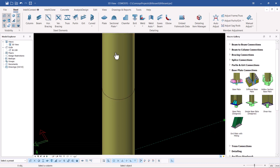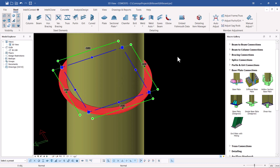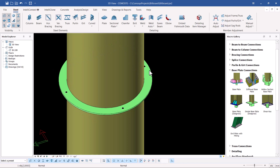I'll come to base plate, and then to hollow section base plate. I'll select that so I can see the base plate in place. I'll double-click on it to get the editing dialog box. I've double-clicked, but the editing dialog box I got is just for the plate at the bottom end. With it still selected, I'll press M then N on the keyboard to bring up the property dialog box for the hollow section base plate.